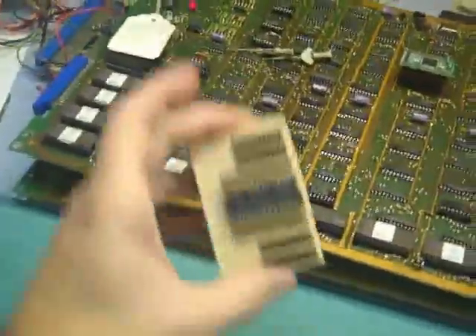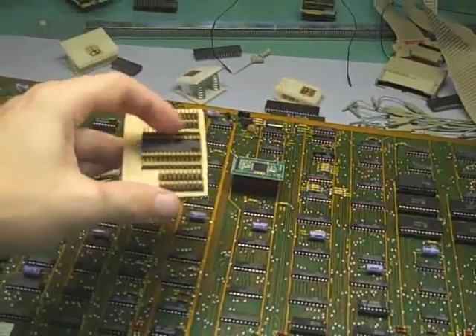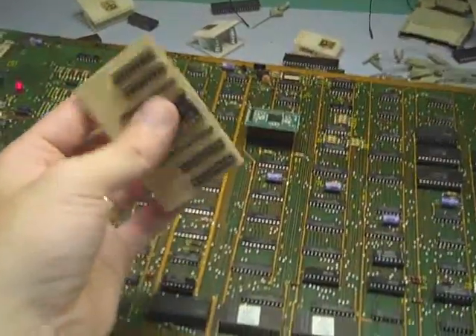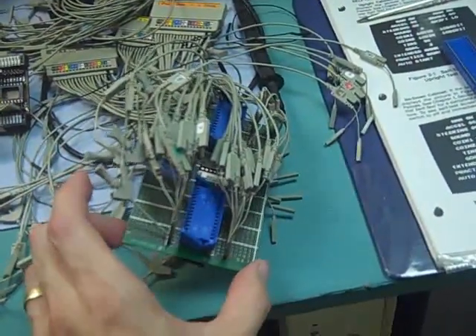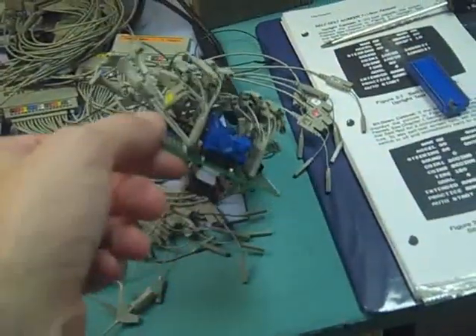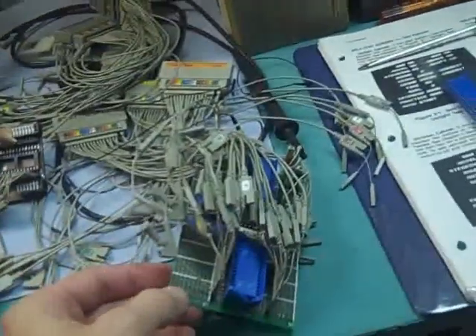You can see the progression of my daughter cards. This first generic one I used way back when just troubleshooting my custom — I could hook up my logic analyzer to it and see what's going on, but I couldn't compare to anything, so it was limited. Then this is the 10-series one I showed in my other video, with built-in XORs and pull-ups, custom to just the 10-series. A lot of these other customs don't have open-collector outputs and things like that, so this was a one-off — I didn't etch it, just soldered it all together.